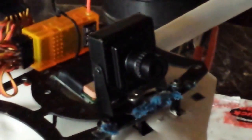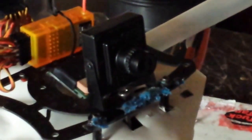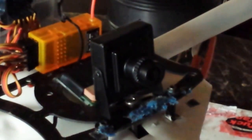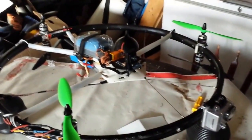There are analog zoom-capable cameras of this type that we would have a mechanical servo for. This is a cutting-edge kind of thing. What's the resolution? The zoom is 40 times, I think, with a 20-millimeter lens. And then what's the resolution of the final image, if it's going to go through the wireless device? This particular piloting camera is a 700 TVL camera. I don't know how that translates, I think it's 720 by something. It's pretty good. Now, my display is only displaying 640 by 480, but at least the camera, and you saw the image, it's a pretty good image.